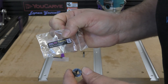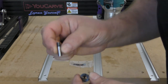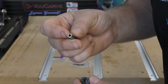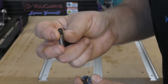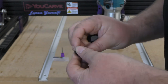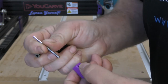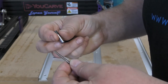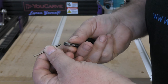We'll have a look at our little sleeve adapters. Specifically today we're looking at one of our Turbo Cut quarter-to-one-eighth adapters. You'll notice there are two sides to this adapter — one side is silver and the back part is black. The black part goes inside the router, and your end mill goes inside the hole on the silver side. We're going to grab one of our one-eighth two-flute straight-cut end mills. It has a one-eighth shank, and the black side always goes into the router itself.